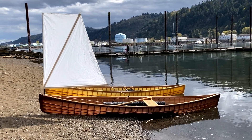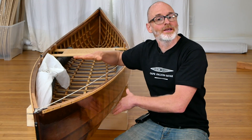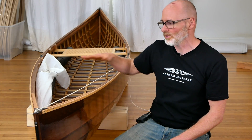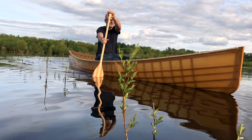What I ended up building here was a little bit of a hybrid canoe. This boat is 13 foot 9 inches long by 28 and a half inches wide, 10 and three-quarter inches deep in the middle, and weighs 26 pounds empty or 30 pounds with the sail, flotation, and seat installed. Personally for my size — 5'8", 165 pounds — I like a pack canoe at 27 inches wide, 10 inches deep, and about 13 foot 5 inches long, and a full-size solo single-blade boat at 28.5 inches wide by 12 inches deep by about 15 foot 3 inches long.